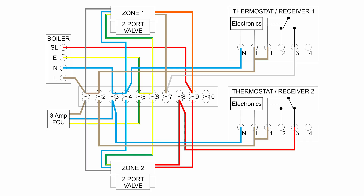If both zones actually require heat, both thermostat receivers are on — all the highlighted wires become live, both valves are open. There's only a single wire going back to the boiler, and it doesn't matter which one's powering it, because the boiler switches on either way, and water is heated and circulates through both zones. The basic essence is: each zone has its own thermostat which provides power to the valve for that zone. A switch inside connects the 230V grey input to the orange output, and that connects to the boiler to turn it on. You could extend this to as many zones as you want by duplicating the setup — a third receiver and valve would wire up exactly the same way, with the orange output always going back to terminal 9.